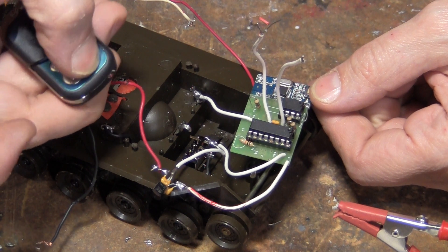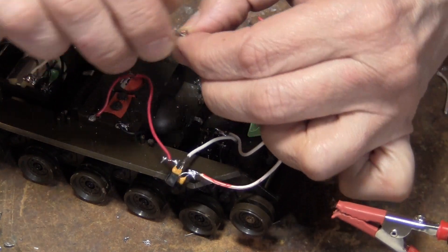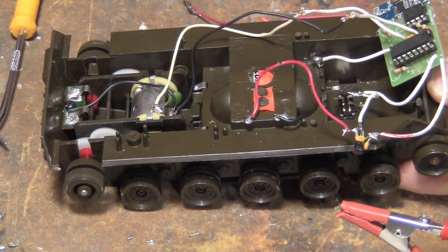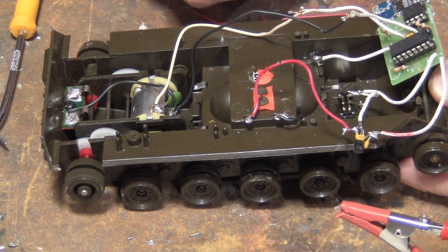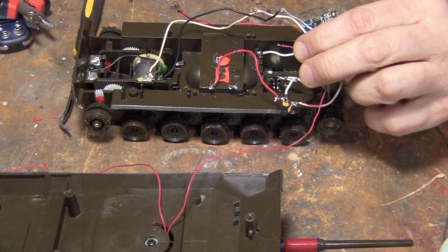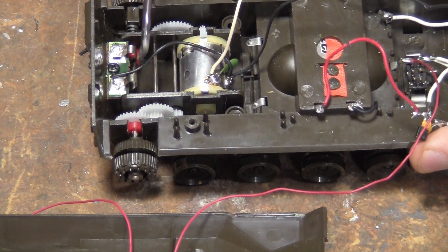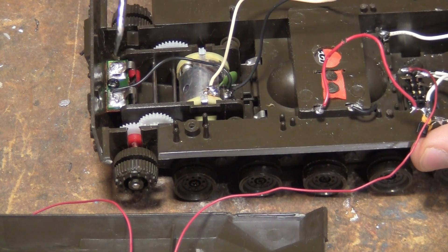There it goes. This one to here, and this one to here. So now when I turn it on, the motor should go in one direction, and when I hit the button, it should go the other direction. Now there's a light in here that's supposed to be the firing — that's what this right here is for, because it's only supposed to get three volts and not full six volts. And then over here, this is a switch. It's touching this shaft, and the shaft has a little red thing down here, and it makes this one connect and disconnect. So that's acting as a switch.